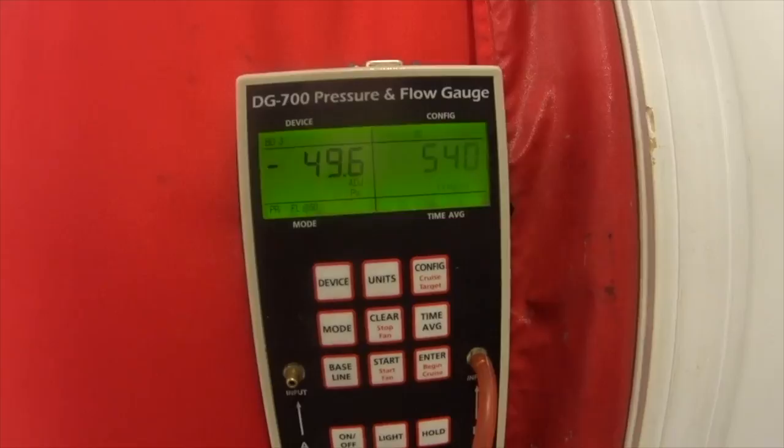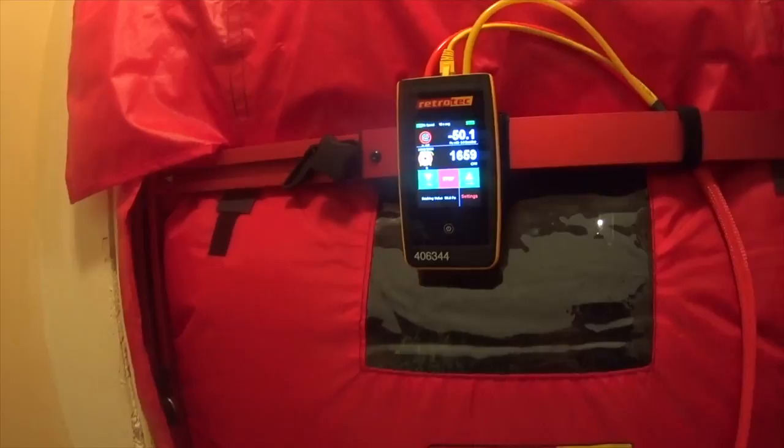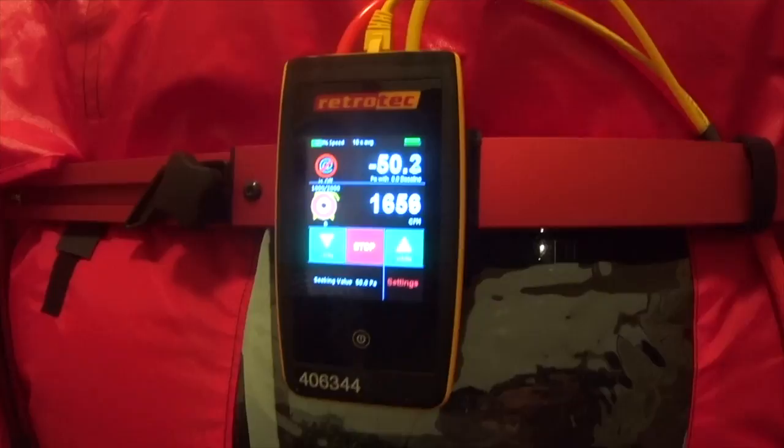Okay. So let's go see what the downstairs is, or the front door. Now we're pressurizing the master to 50, and the house is depressurizing to 50. So that cuts off 1600. That about adds up, because the house was about 2100 overall, right? So 550 plus 1650 is 2100. So yeah, that adds up.